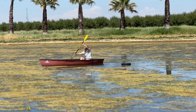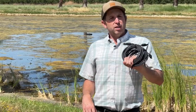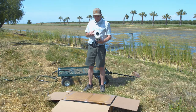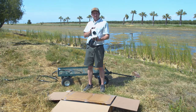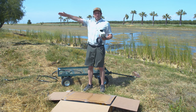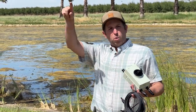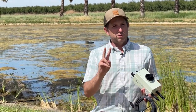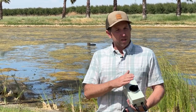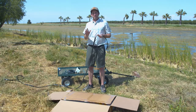With our fountain out in the lake, we're going to do our final electrical connections. I've gotten out our 20-foot solar extension wire and our DC disconnect. We're going to plug the solar extension wire in here, our pump into the bottom, then take this wire and plug it into our solar panels. Our solar panels were pre-configured all in one long chain, so we have two final connections — one for positive and one for negative. We'll hook that up, turn our DC disconnect, and get the system running.